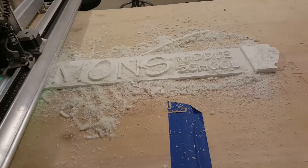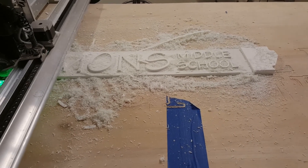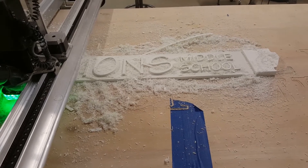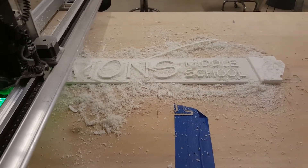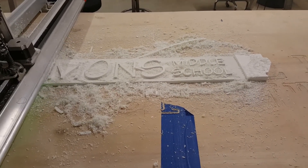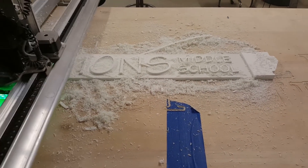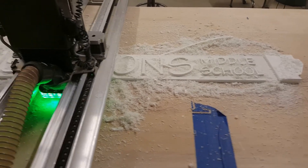It's a gimme — I just wanted to do something with spare leftover material since I was a little late getting it to them. Being PVC, you can paint it, put it outside as a bulletin board or sign board, and it'll look good. It holds paint better than wood. The finished product for cutting letters was much easier and faster with this too. A little more expensive than painted pine, but no touching after cutting — just knock the tabs off with a flush bit router and off we go.